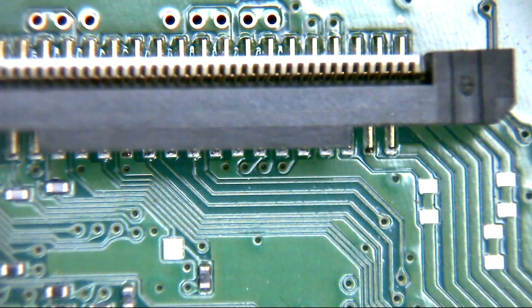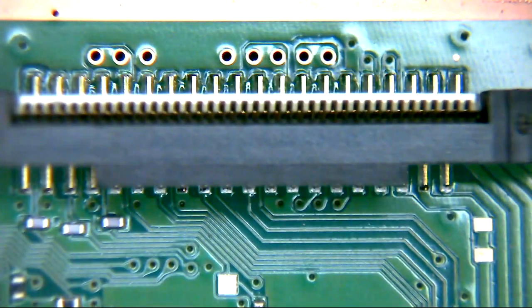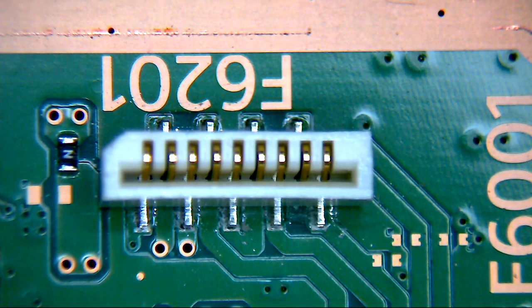So once you've got that familiarity, we can start to make some assumptions. That's good in a way, I suppose, because all our fuses are intact. We know our issue isn't going to be a fuse problem, which is pretty cool. But the issue now is we need to know exactly where our issue is. So now we have to find the portion of the circuit which is responsible for sending and receiving those commands and processing them through the drive board.